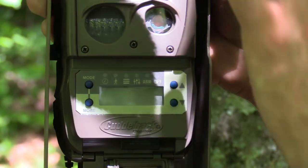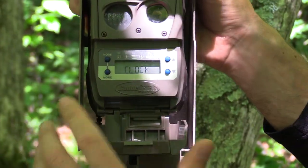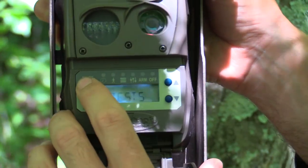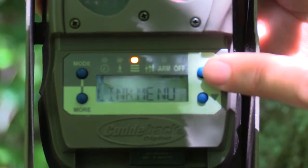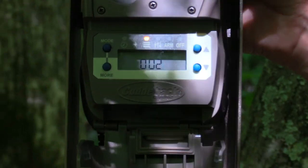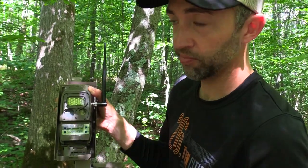We have this set up in the J safe with the battery power bank connected. Now we're going to turn it on and verify the settings. Hitting mode to clock — the date and time was set on this this morning. Hitting mode over to commands, then more to get to the link menu, and once on link menu hitting up twice. Now this is a remote camera — we've got remote. The location is two, so the home camera was location one and this is location two. Channel 531 — very important, the remote camera and the home camera have to be on the same channel or they won't work.